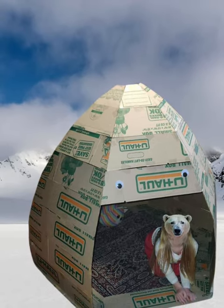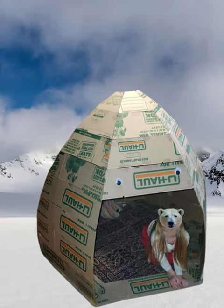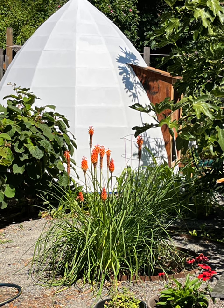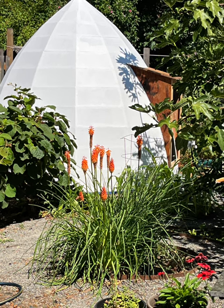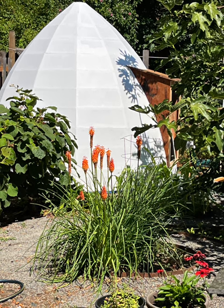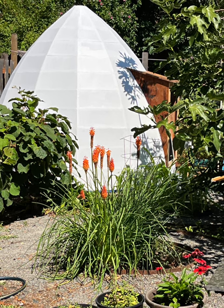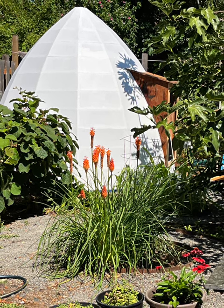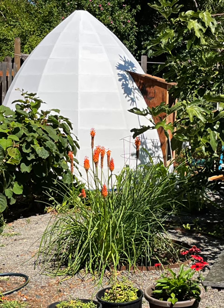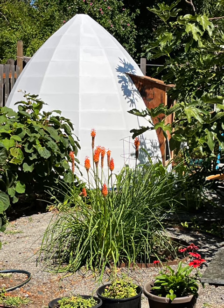The math required is easily calculated — as simple as a game of Sudoku, calculating one angle at a time and charting it into place. This dome has 144 trapezoid panels but only 12 different sizes. This experimental structure should be considered a prototype, best suited for huts. I chose this dimension because it fits the space; I would have preferred a 12-foot diameter.